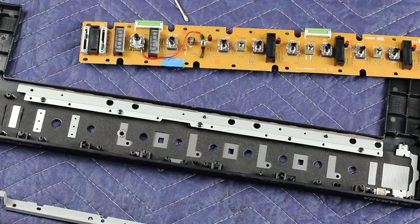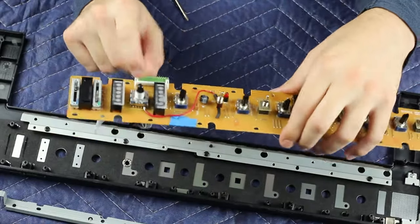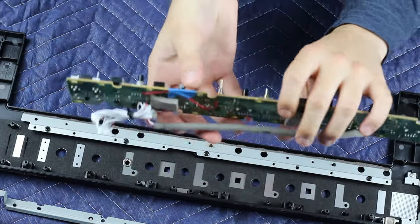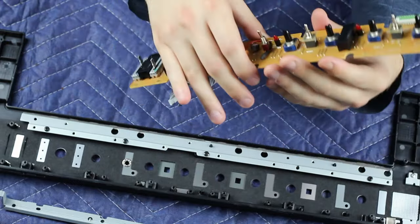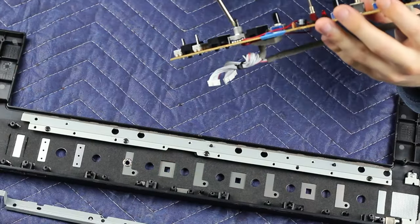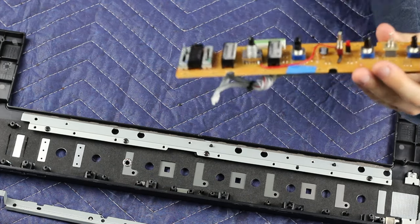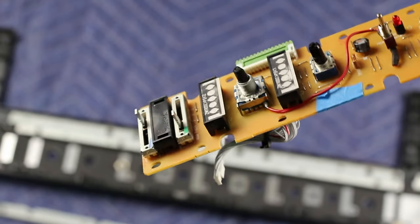Fragile. Now this may look like a potentiometer but it's actually a rotary switch — this is the voice selector knob. Locate the lug that goes to the toy piano voice; the lug I've soldered the red wire to is the lug we want. De-solder that lug on the underside using your preferred de-soldering method — personally I use one of those spring-loaded solder suckers. You'll probably want to carefully bend that terminal and remove it from the hole in the PCB, or carefully snip off the part that goes through the hole, as long as you leave enough to solder to on the top side. The point is you don't want that pin from the rotary switch connected to the pad on the PCB.